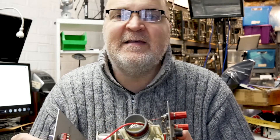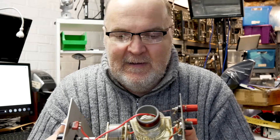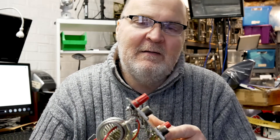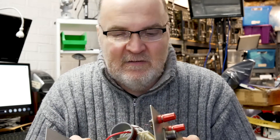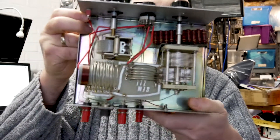It's fully balanced as I said, it's a Z-match. Z-matches also act as bandpass filters, which means operating frequencies above or below your operating frequency will be suppressed. So cleaner signals and less interference in your receiver. This one is particularly clean.